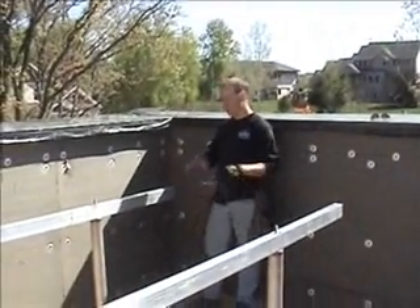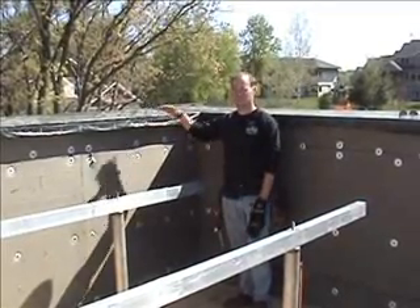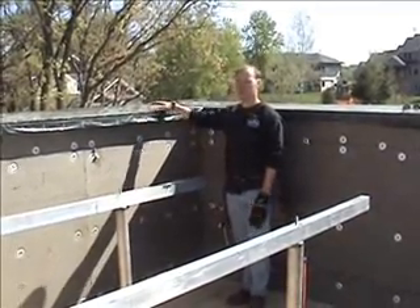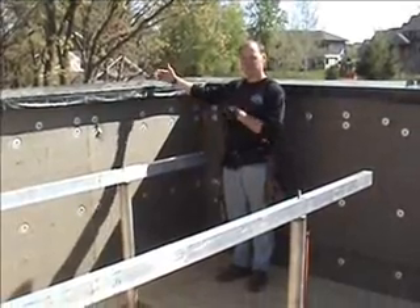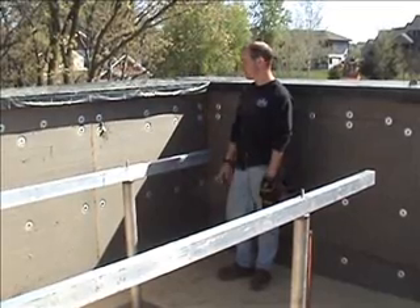He'll be about a foot taller. We will be standing on additional insulation, so this will actually be closer to 36 inches in height. This parapet wall is roughly 30 inches deep, which will provide a nice safety barrier between the homeowner and the outside.